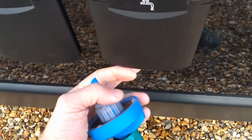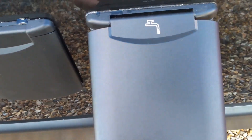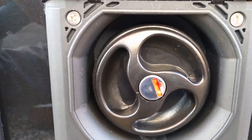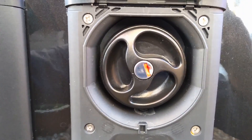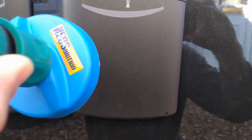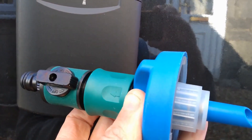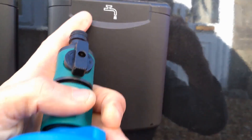The water inlet we're using is a Farrow inlet from Rainbow Leisure. It's magnetic and there are electrical ones to match. It comes in white, grey, and black — this is a black one. It's got a lockable water cap inside and there's a breather behind, so it'll allow the tank to vent externally. Bear in mind if you buy one of these, the instructions say to use a 90mm hole, but in our experience we had to go to 95mm. So check on some scrap ply before you drill a hole in the van. We've also got a HEB fitting that clips on so you can connect your hose to it, with an on/off tab to control the flow. You just clip that in, clip your hose on, turn it off when your tank's full, and the overflow will just come out the top.